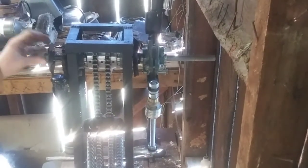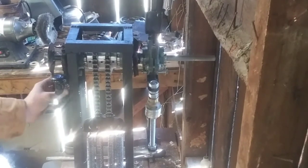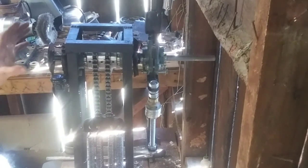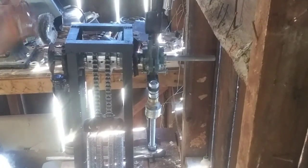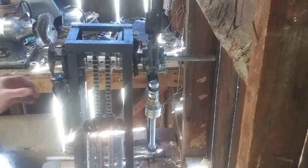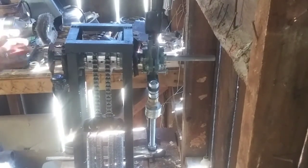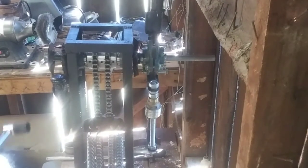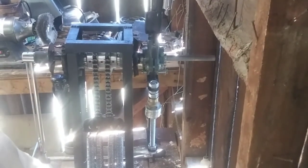Every single time that this gear clicks, it gets locked by that pawl, and the fact that this spring is over here on this side, this is the safety of your machine. Even if you were to bump into this or hit it or something was to break or whatever, this gear is going to lock pretty quickly. It's going to go maybe one tick backwards and that's it. So you can feel pretty secure that it's nice and safe.